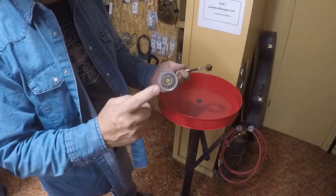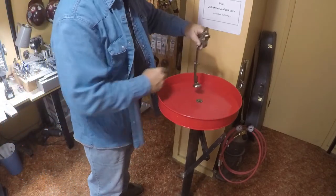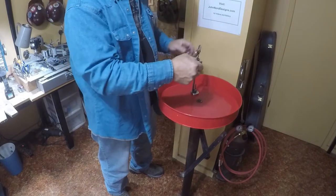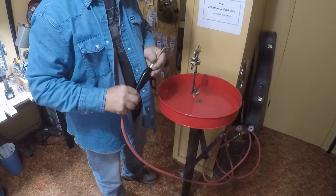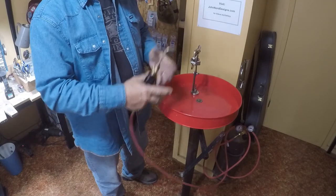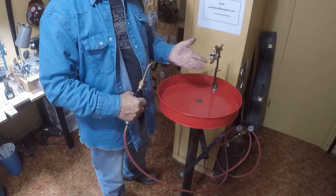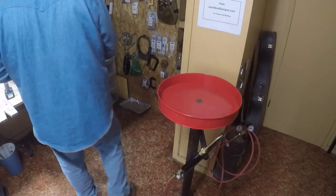This is a magnetic holder I wanted to show you. It's got an earth magnet on the bottom and a pair of C-clamps on top. It's got a couple of adjustments so I can adjust it. I just stick it in this pan, and man, it's stout. It was not coming out of that pan unless I get on it and lift it out of it. And I put spurs on this to have room to work around them. And I also put buckles on it sometimes to solder the overlays on. It's just a great third hand, and it's not a big heat sink. Spurs work great because spurs are hard to hold to solder items onto. So it's been a great help, and I couldn't do without that. Easy to build too.